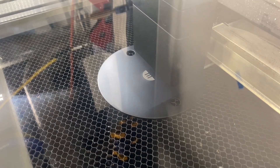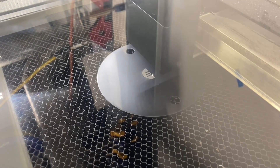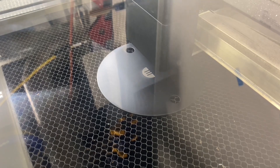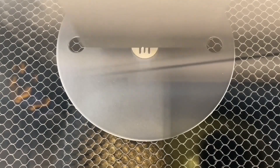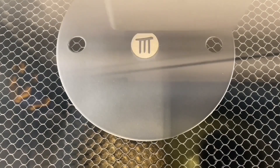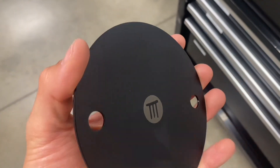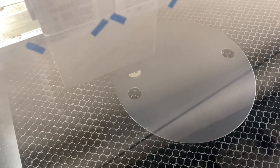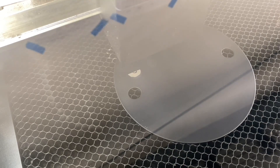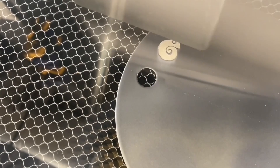The first pre-assembly step was to engrave the powder-coated metal plates received from SendCutSend — something I didn't do for prototype one, but probably the thing I was most excited about. I'm using a Glowforge, which is an at-home laser cutter, to essentially melt away the powder coating. I'm putting my personal logo on one side and the chameleon logo on the other side. During this process I tested several different parameters to find out which would work best on this powder coating — now I know the right laser speed, power, and resolution for next time. After they're done, they need to be wiped down to remove the excess cloudiness from the surface.